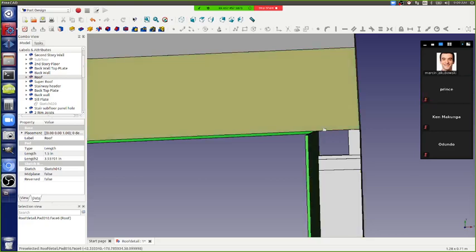I'm not so familiar, but what I would do is analyze, okay, now we have the siding and you've got a certain screw schedule and you know that every screw or nail has X pounds of holding force. And a general good figure is like 200 pounds per screw. If you screw something in, the shear on that screw is about 200 pounds of force before you actually break it. So you've got a load of screws, like 200 pounds each times like 100 or 200, however many you've got all over the plywood. Back of the envelope, I'm looking at 200 times at least 100, it's like 20,000 pounds. Are we ever getting 20,000 pounds pushing on this laterally? Hell no.